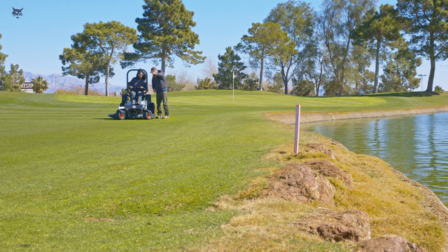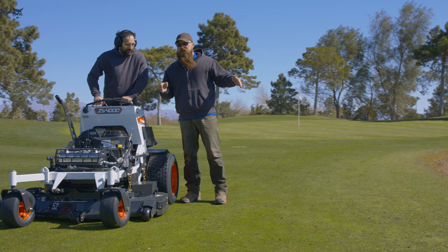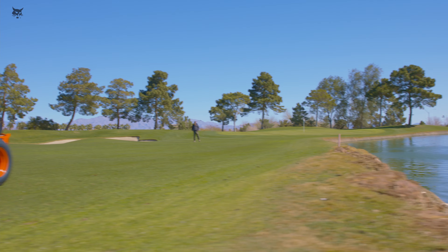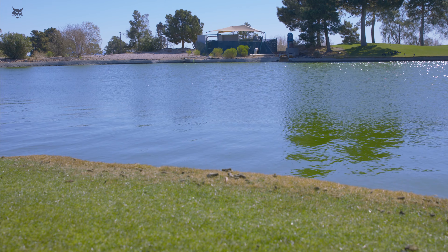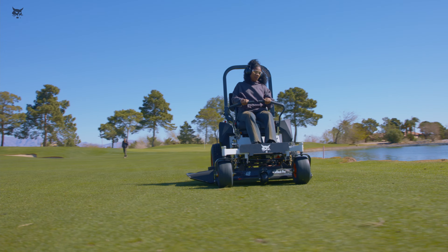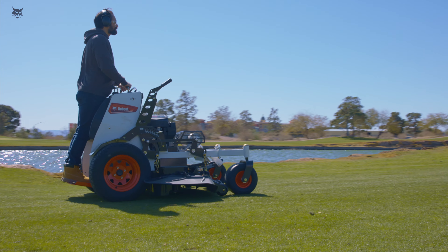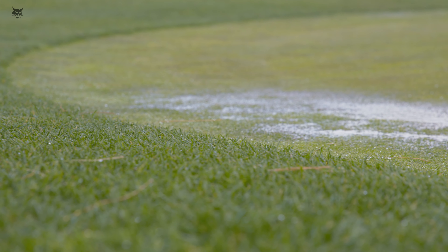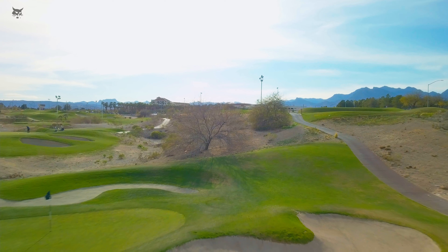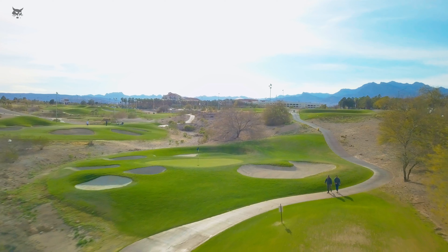Establish a safety zone to ensure that the mower is operated at a safe distance from such hazards. Mowing near bodies of water also requires caution. Not only does the ground often slope near water, but it also may be soft or muddy and can cause your mower to roll over or become stuck. Inspect areas surrounding water on foot before you get too close with your mower. Remember to maintain your safety zone from the edge of the water. Even if there is not a permanent water fixture, recent rains may cause water to pool in low areas, so use caution around depressions. When in doubt, inspect the area on foot and use a walk-behind mower or string trimmer.